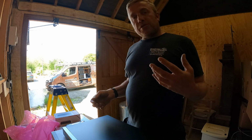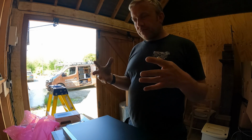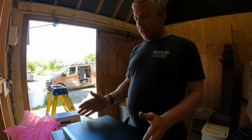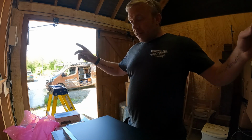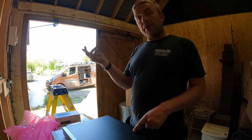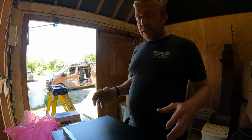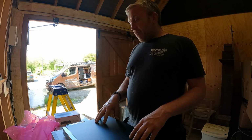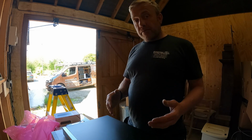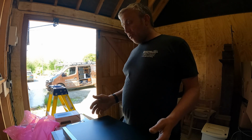And you've got to pay a subscription to store it in the cloud, so you don't actually have any physical recordings yourself. So this is a recorder. All the cameras are cabled back to this, and the power injectors will power the cameras. There's no separate power units. It's an IP NVR recorder with PoE ports, all right? And this is what powers the cameras. So yeah, that's all fine.